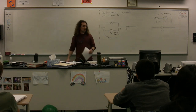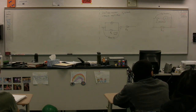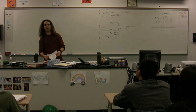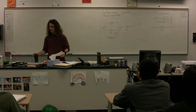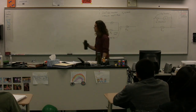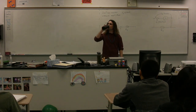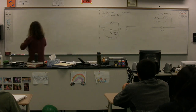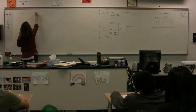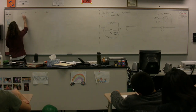Now we're going to talk about outlets in your house — household wiring. The electric potential difference across the outlets here in the United States is 120 volts. We also have some that are 240 volts, like your air conditioner. In your house you have wires: one at 120 volts, one at zero volts, and one at negative 120 volts. The ones at positive and negative 120 volts are called live wires.